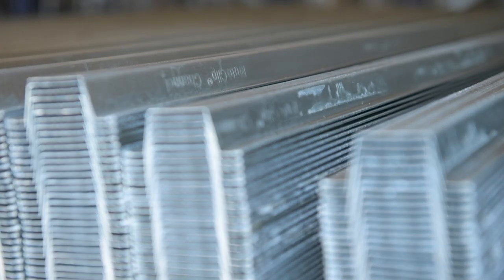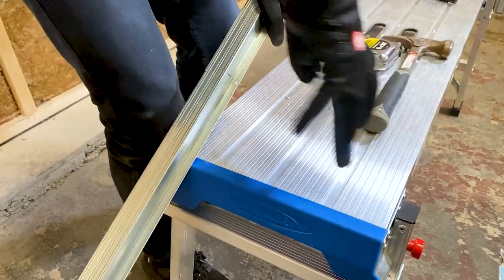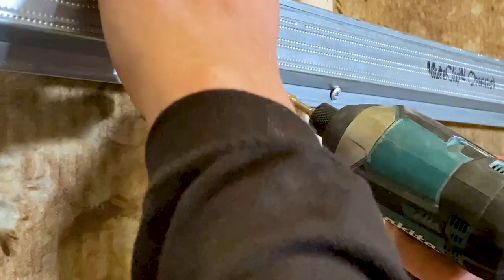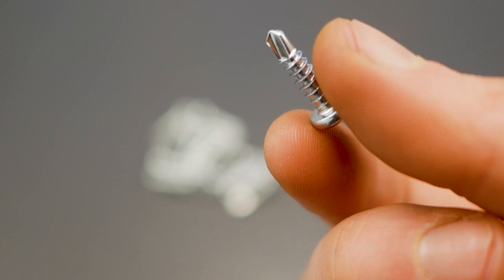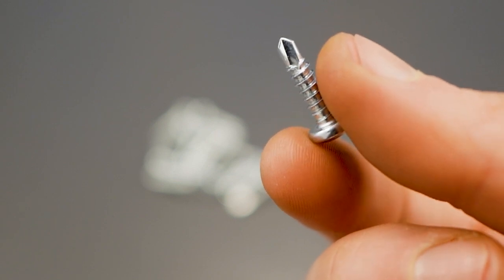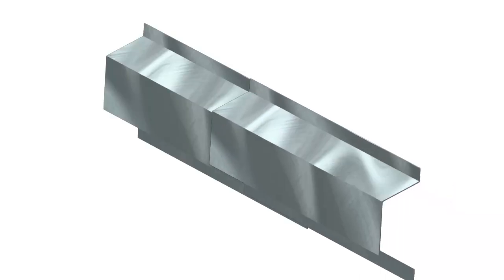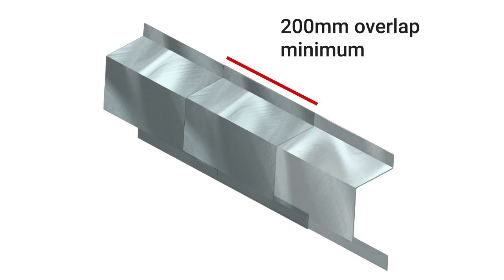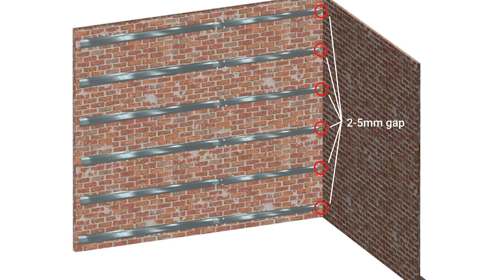Unlike dual fixing systems where clips have to be fitted perfectly parallel, the mute clips can be straightened up as you go along, so the channel is much easier to fit. The channels come in lengths of one and a half meters and can be cut shorter with a pair of tin snips or a junior hacksaw. If the channels are too short they can be overlapped and fixed together with four 20mm steel self-tapping screws into the shoulders of the channels. The channels need to overlap by 200 millimeters for a secure fit, and this join shouldn't happen over a mute clip as the added width can't fit into the mute clip claw.